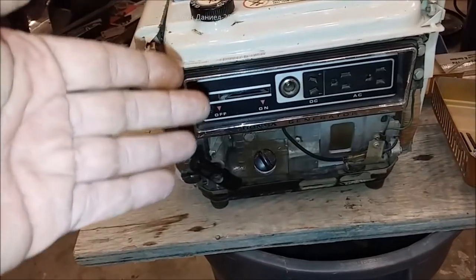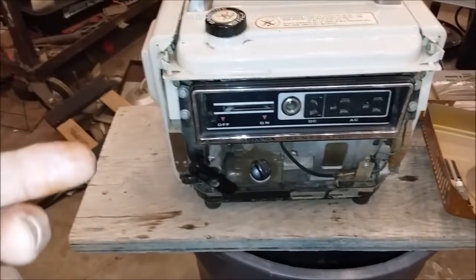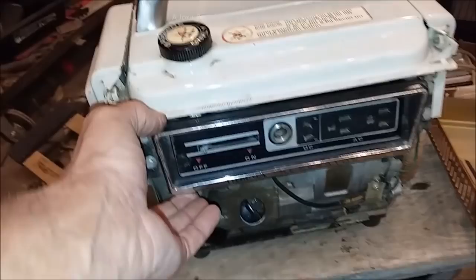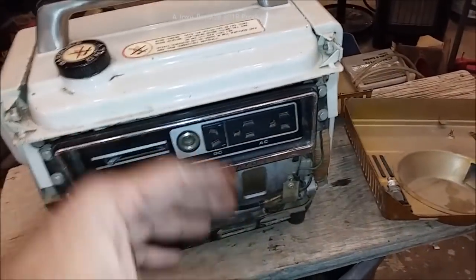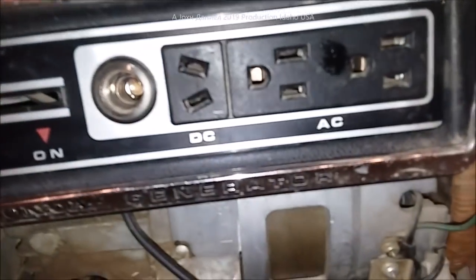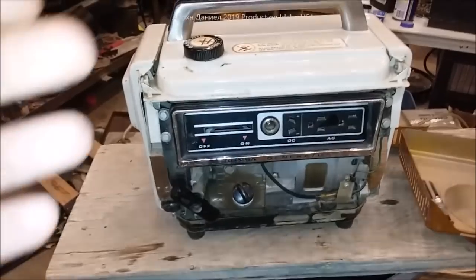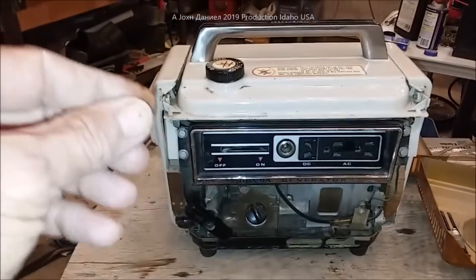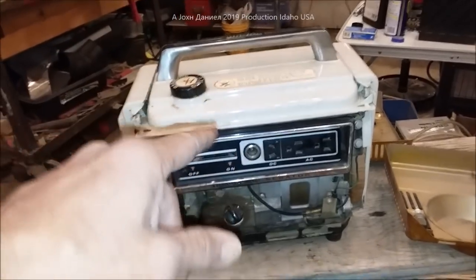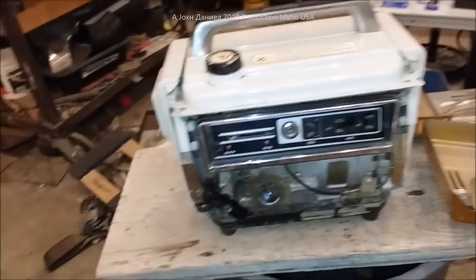We're going to fire it up — we haven't done a voltage test on it yet, but will it run? That's the question. We're getting spark and everything else, so we've got new gas in it. We cleaned the gas tank — a very difficult procedure for this thing requiring removal of this panel. You can see all the wiring; it's a pretty simple setup. Even though it has what appears to be grounded outlets, it goes to nothing — it doesn't ground to anything. So it's just 110 wild voltage. You've got both your common and your hot. This will not run a computer; it will only power some lights and old-school electrical goods with large transformers.